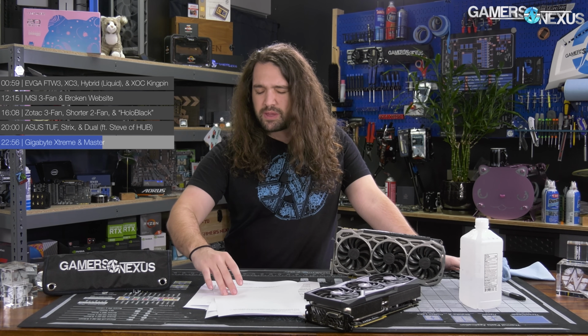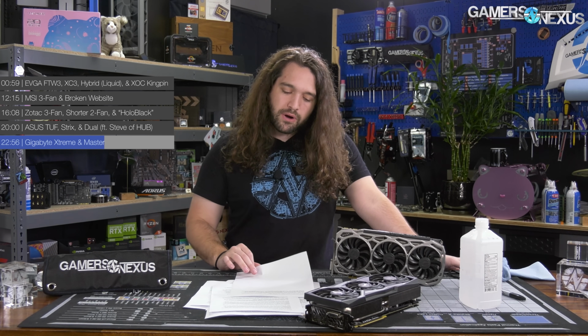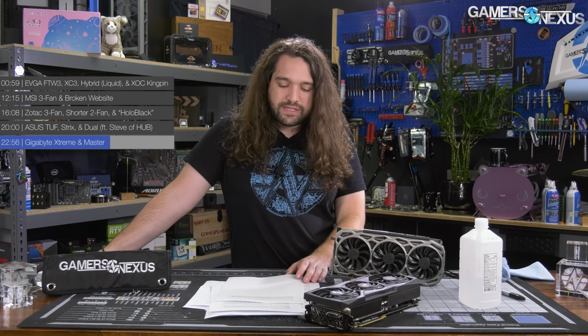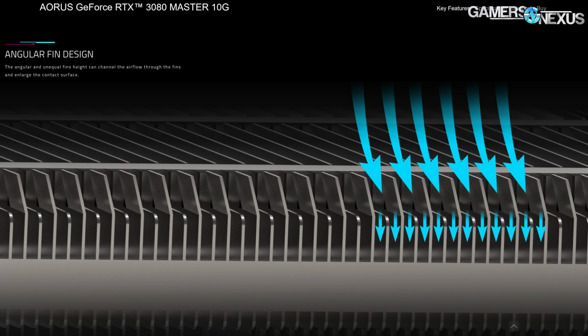The render makes it appear as if maybe a base plate's used for memory, but we'll have to take it apart. The vapor chamber feeds into the heat pipes, and then the more traditional fin stack. So everything's pretty standard here, and we can see an aluminum fin stack on either side as well. That's explicitly where the VRM would be located.